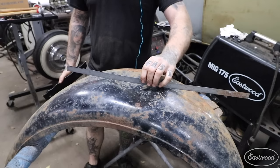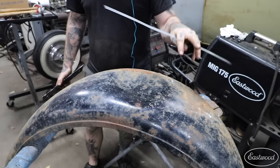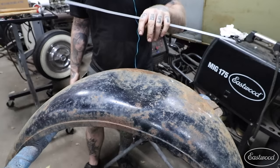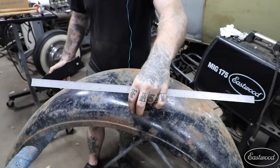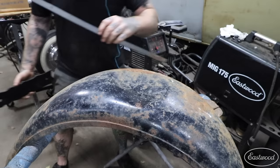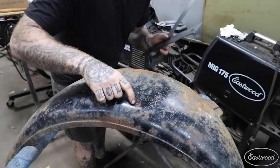I'm going to show you just the extent of the damage here. You can see with the straight edge we've got a pretty deep dent, and one of the big things is there's a big ridge. There's always a cause and reaction when you have damage like this. If you read the panel before you even start hammering, you can figure out what happened. When it hit somewhere in here — looks to be the deepest area — it pushed something over and you have a high spot here and everything's really low in there. You can tell where the worst damage is by paint loss or cracking.